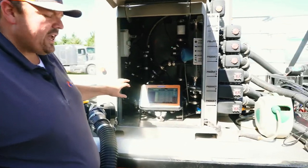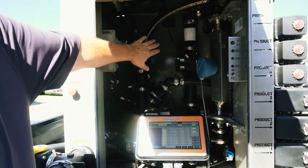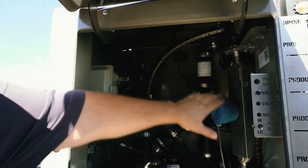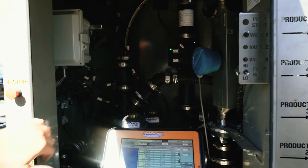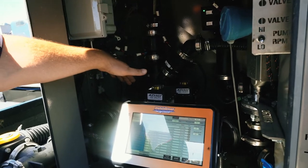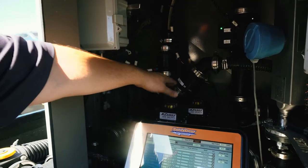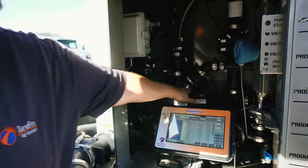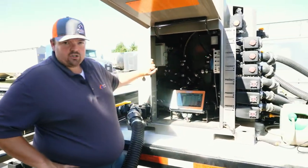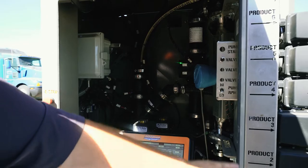Internal to the Quick Draw, let's just take a quick look at the plumbing path. In the very back, we have our three-inch inlet. The meter with the green light on it is our three-inch carrier flow meter — that's what's going to measure all of our water or whatever we're using for carrier. We come up at the top and then it's plumbed all the way down into the bottom across. This is our Venturi module. Our Venturi assembly lays across the bottom of the cabinet. The front side is our three-inch bypass — anytime we're just pumping carrier water, that's going to be open, giving us full three-inch flow through the system. The back is the Venturi valve. Anytime we're drawing chemical, the three-inch valve is going to close, the two-inch valve is going to open, forcing water across our Venturi and creating suction. That suction is then applied through the mass flow meter and then onto our valve stack.